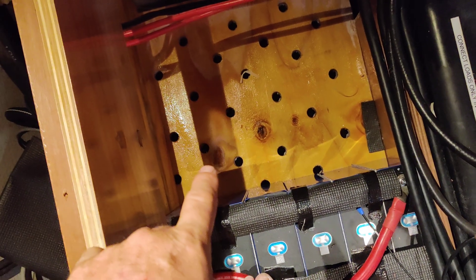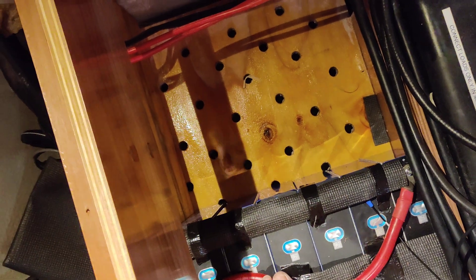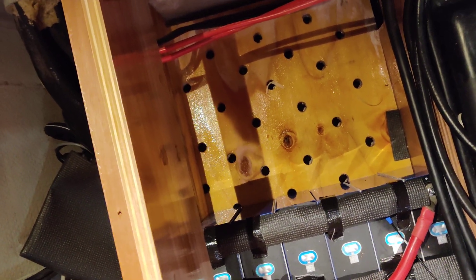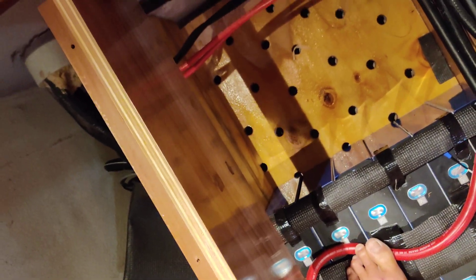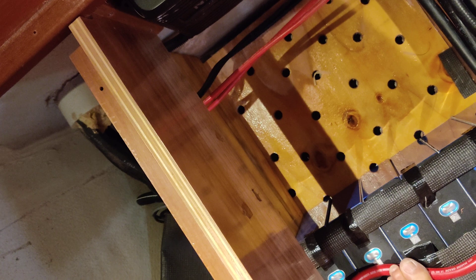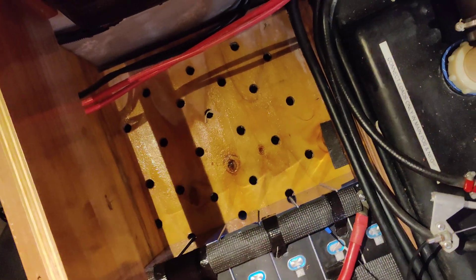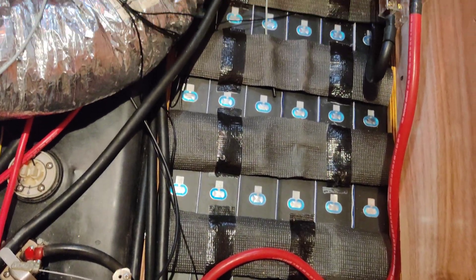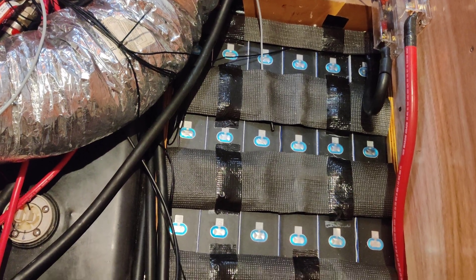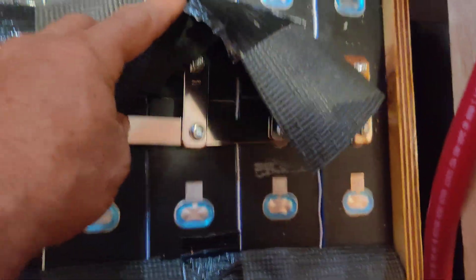I'm really happy with this job. I built a battery floor so that we can put fans or heating underneath. If the owners on their trip across the Pacific decide to go to the South Island of New Zealand, they can put a thermostat with a cheap 12-volt eBay heater that'll put heat underneath the entire system. This is 1,680 amp-hours of lithium iron phosphate, and I put protective covers on all the bus bars in case I drop a tool.